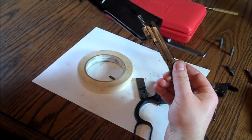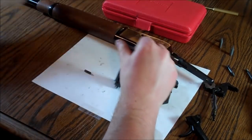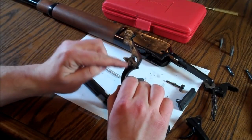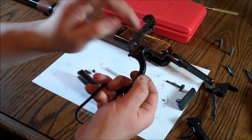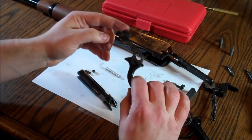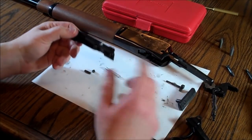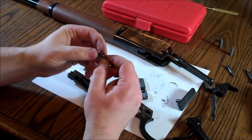When you're in here, you're going to want to go through and clean up all the wear marks, polish them a little bit, make sure you don't have any burrs or anything. After you work the action a little bit you'll see wear marks — so I went through and polished all those pieces. While you're polishing, don't get carried away. You want to stay a little bit higher than I did because you can see a little bit of where it polished when the lever is closed, otherwise you're going to have to cold blue it. I would also clean up the ejector — polish it, find any rough spots, burrs, anything like that.